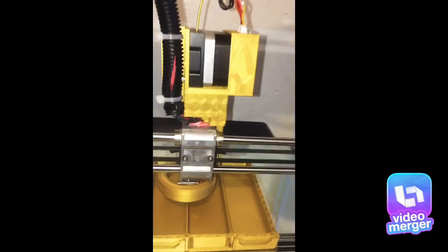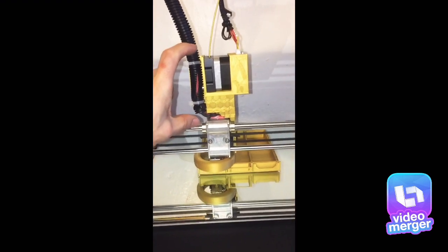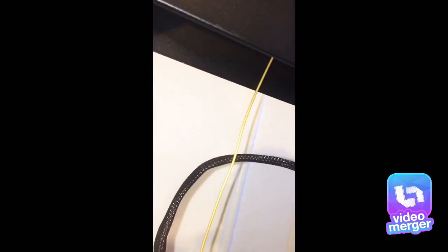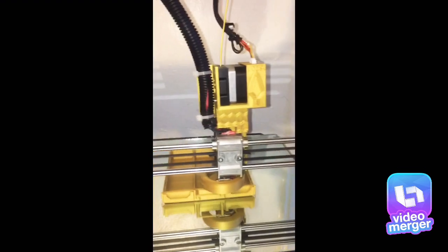Two more things. When I made this like 2 days ago, check the height. That's something you're going to be trading for using more filament. At about something like that, your height is going to be less by that margin, more or less, and the mount goes through pretty nicely. I raised the z-axis manually to see if it would bump, but it did not, so we're good there. But yeah, we definitely are not going to be able to print that 320 millimeter height, so that's one thing to note.